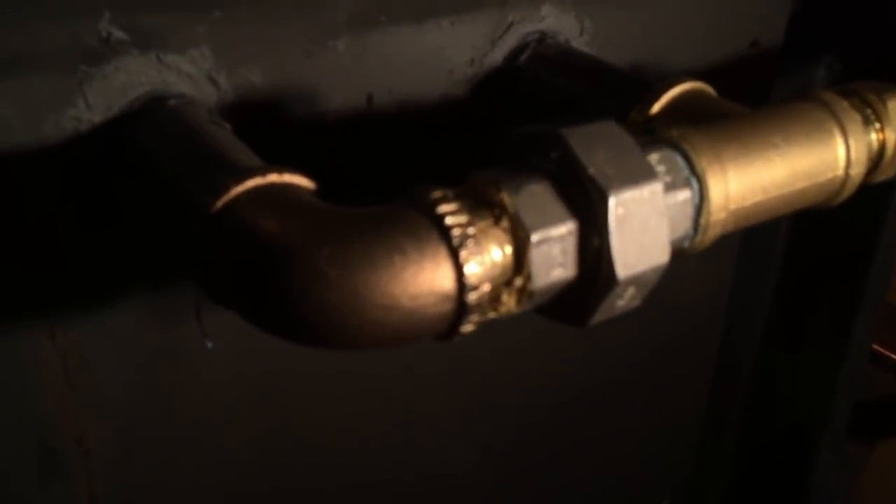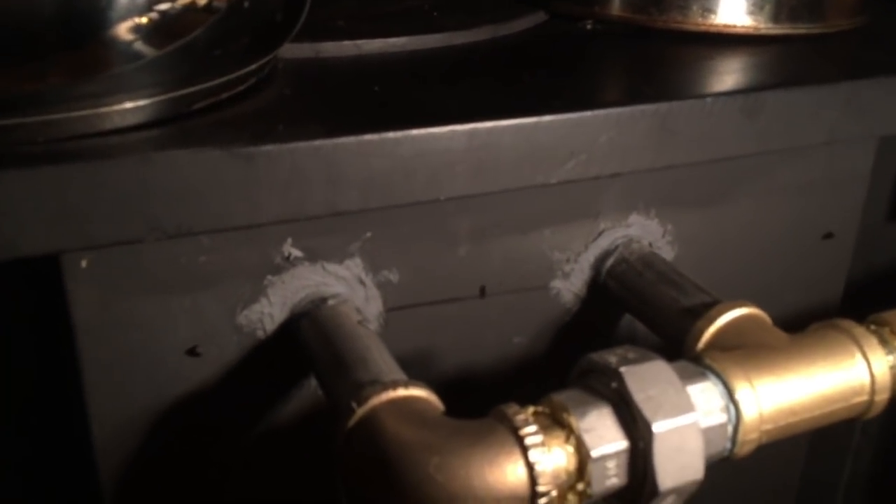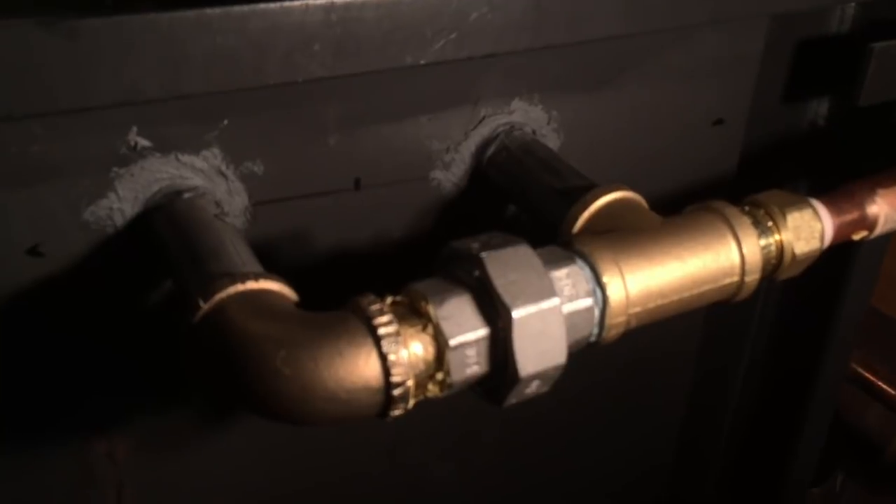Those two pipes go through the stove, through the top, under that hob — under the dog bone — because we don't want to heat the water in the firebox, ideally, since you want the firebox at as high a temperature as possible. That's one big innovation of this over the Stanley hot water systems, which we've done a number of. The two pipes come out the back.